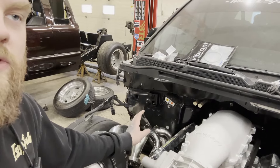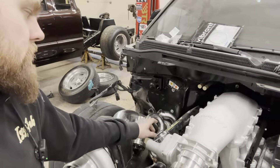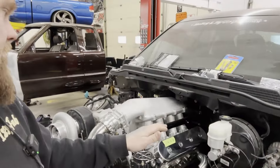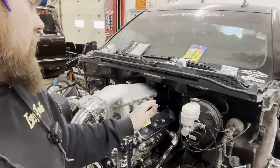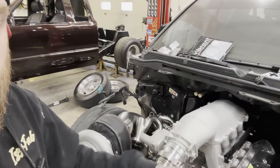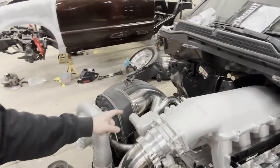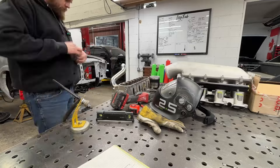The ideal runner length from what I've read is 15 to 25 inches, so these at 15 and a half are about as short as I'd ever want to go. Cylinder 7 is probably going to dictate how long everything else needs to be. I'm going to aim for 15 to 16 inches on this side, but if I have to modify to hit 17 or 18 inches that's okay — I built that flexibility into the collector. So I'm going to start tacking some tubes together.